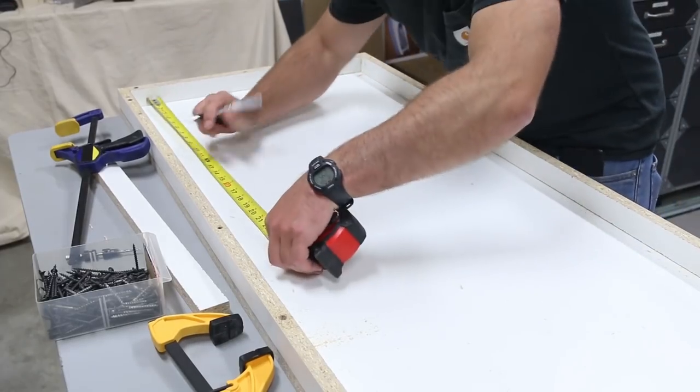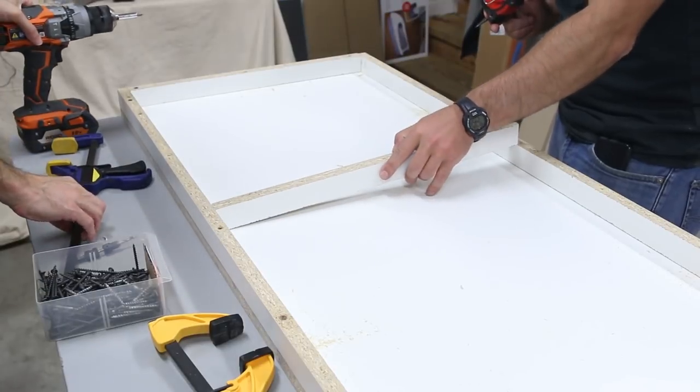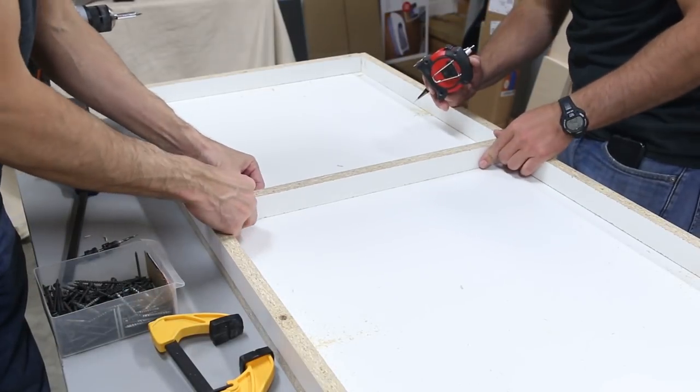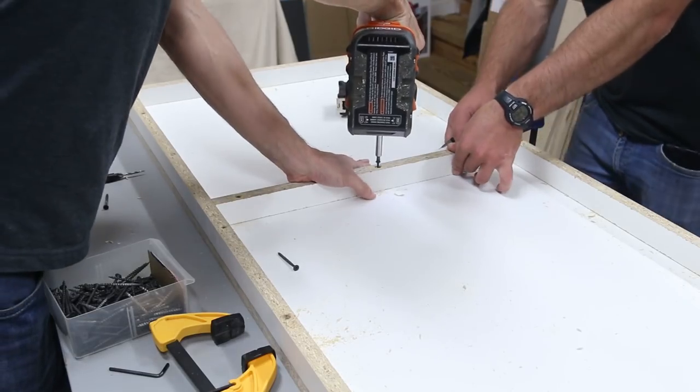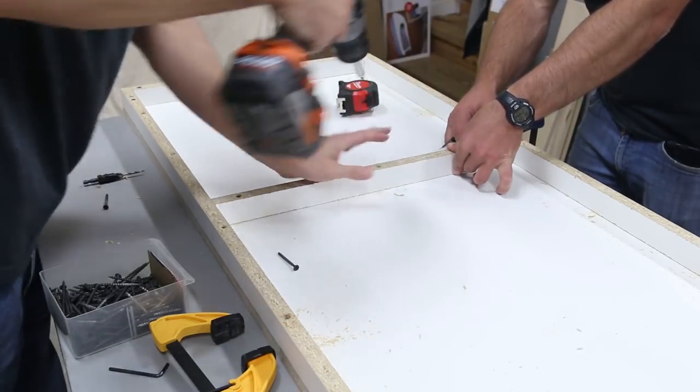The tops are 20 by 20, so Pete measured in 20 inches from the end and then we attached the center divider. Using that divider to get two tops from one form makes things a lot easier when you vibrate and screed the concrete later.